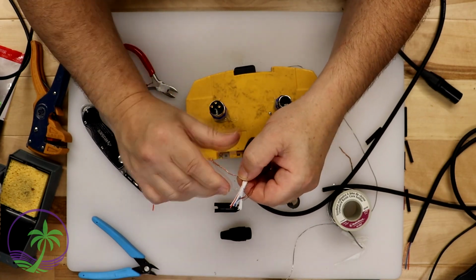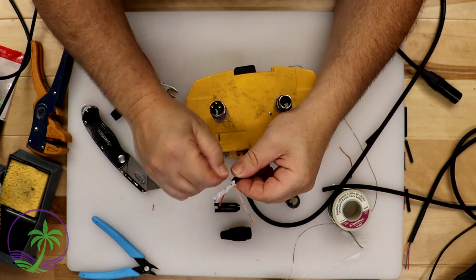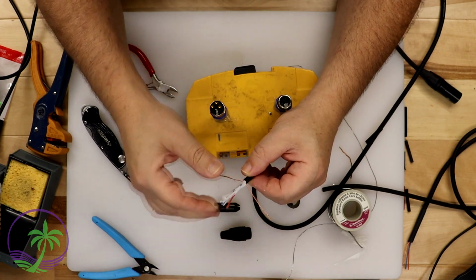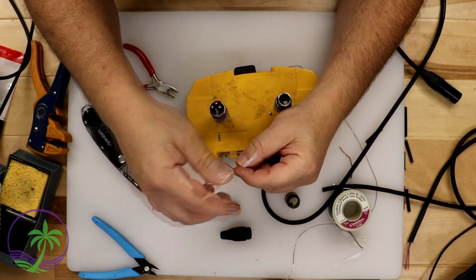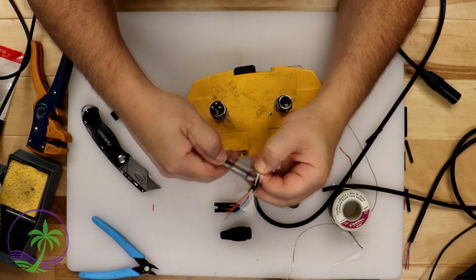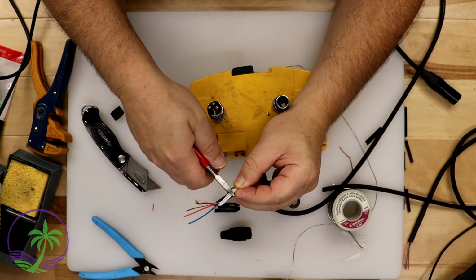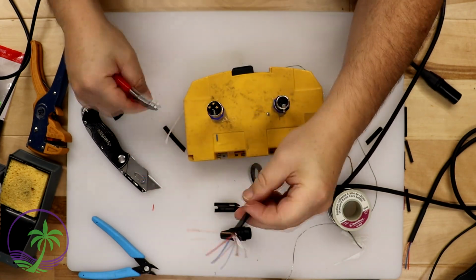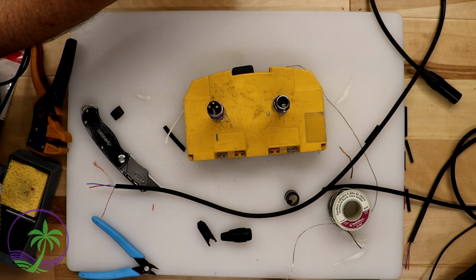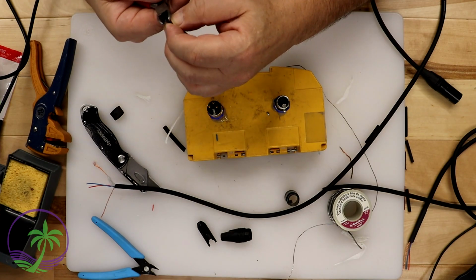Now that means taking the neutral wire and splitting it in two like I did here, and that's okay. It's the same wire. It's one wire that runs all the way through, and what's going to happen is one wire is going to get fed to the outside. Now this wire is also getting set up so this way, if someone's going to swing the microphone by holding the cable like it was a rope in the air, some crazy move with the microphone, pulling on the cable, this is a great way to lock that cable so you're not going to damage the cable. It's not going to stretch out, and it's not going to pull itself apart. Now heat shrink is going to slide over the whole thing, so we're going to put that right over everything.